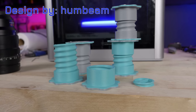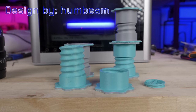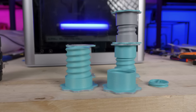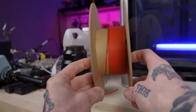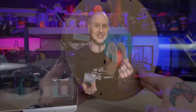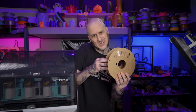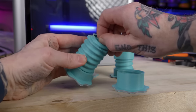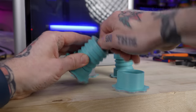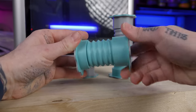These little screw-in doodads are going to fit inside of spools in the AMS and serve two functions. One, they're going to hold desiccant inside of them that I can put in there and help to dehumidify the inside of the chamber. The second function is a little less obvious though. When you get spools like this, where you've got little filament left on it, especially these cardboard spools where they don't weigh a whole heck of a lot, the AMS, as the motor inside of it tugs on the filament, this filament can actually lift up off of the rollers inside of the system and start to bang off the inside of the case or cause feeding issues. So adding these in here with some desiccant inside of them will add a little bit of weight to the spool to help hold it down into the rollers.